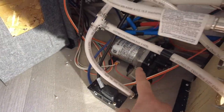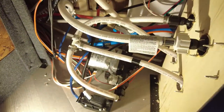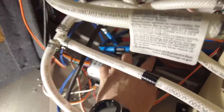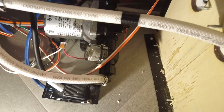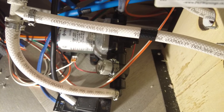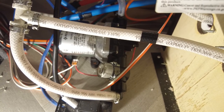There's the pump we need to get to right there. We need to replace this head right here. We need to unhook this hose — the outlet hose — and this hose in the back, which is the inlet hose. This is the one we changed. You can see the shutoff valve we put on. We're going to get a towel to soak up any water that drips, then unhook these hoses and unplug the wires. Make sure you know where the wires came from so you can put them back in the same place.